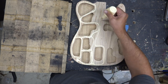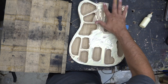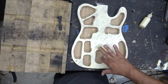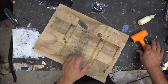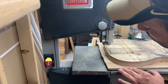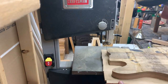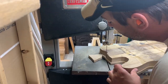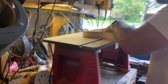We'll come back with some wood glue, get the locator pin set up, pop this together, and spread out the glue. I really do prefer spreading that glue out with my finger - I feel like I just get a much better feel for how much glue is on the piece. The templates are perfect for doing the locator pins. Pound them in, take it back to the wine press clamp, let it sit, then go back to the bandsaw and cut off the waste. Once we cut all that off, take this back upstairs to the router.